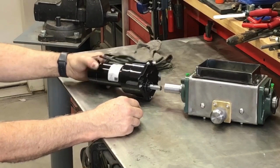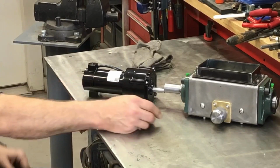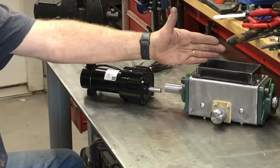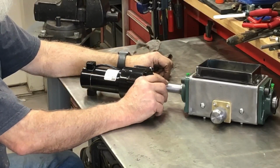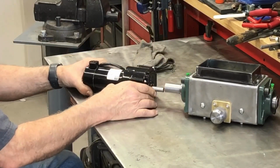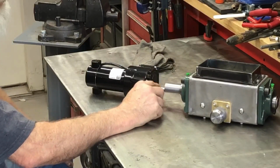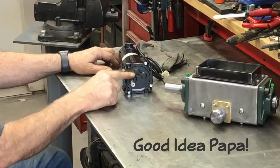And because of that, I'm actually thinking about it. Because here's the thing, this is not a highly precise place. When it comes to a motor, you want this motor to turn this shaft, you can't have any misalignment on any axis of more than 1, maybe 2 degrees. Or else this thing's going to have a spot where it goes around and goes. So I'm actually thinking about getting some kind of coupler, but that part's later, because what I need to do now is mount this.